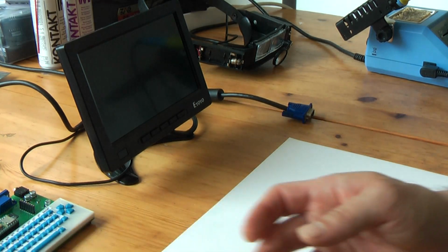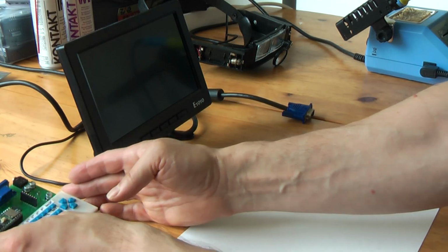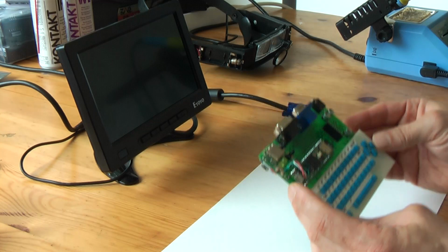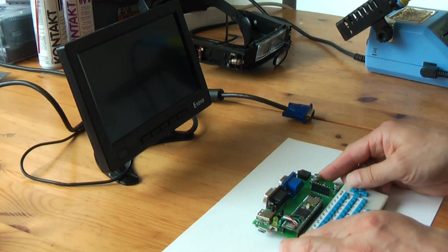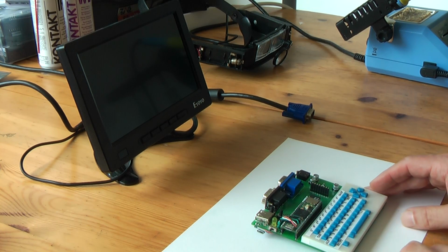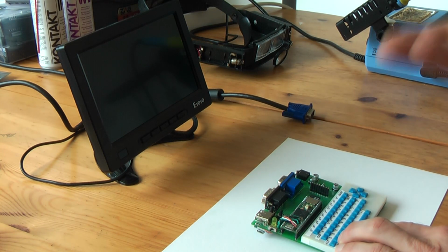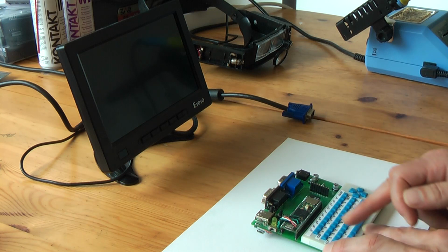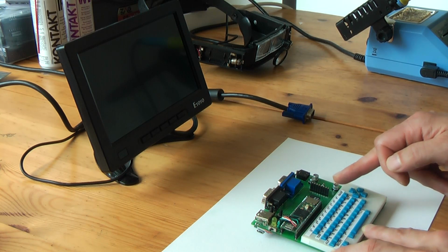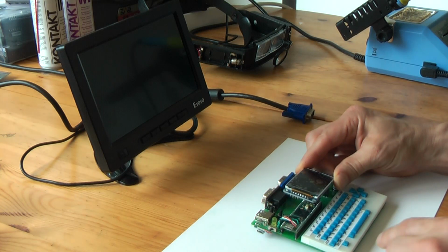But while we were discussing together, I wanted him to also try something with the Teensy. The Teensy MCUs are in fact my favorite microcontrollers. And we ended up with this prototype. The advantage of the Teensy is that first of all it's more powerful. It has VGA output, it has USB, which the Raspberry Pico one had not. It has sound output. It has a slightly bigger keyboard with 42 keys, a 7x6 matrix, and you can also connect a small display to it, and then you can use it as a portable.